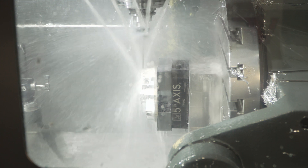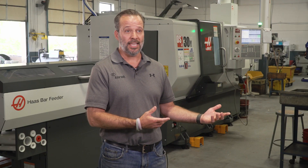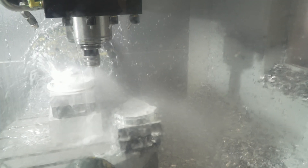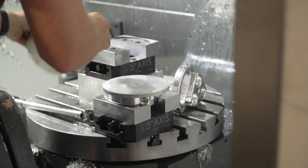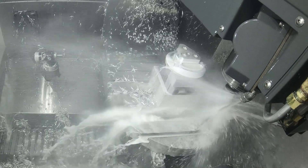One of the other features that we really like is that we're not buying as much custom tooling. You can use an end mill to do chamfers on the side of a part, the table turns, and you can reduce the tooling in the machine to reduce the number of tool changes to help reduce cycle time. With the 750, we can do many different jobs that had multiple steps previously in two vices — rotate everything on vise one, remove material on vise two, and it's a complete part in one shot.